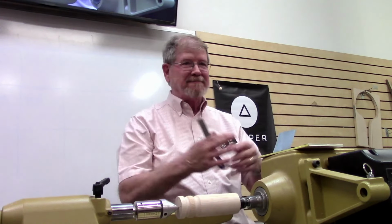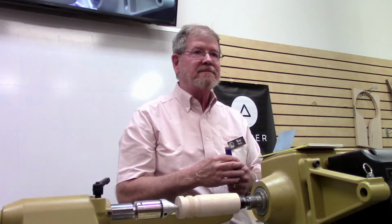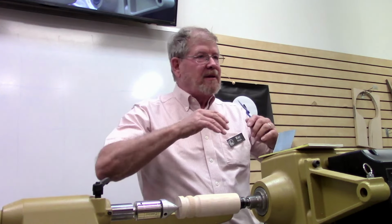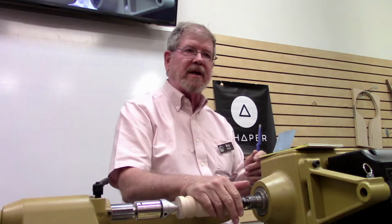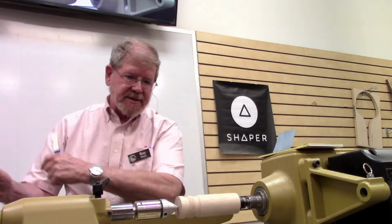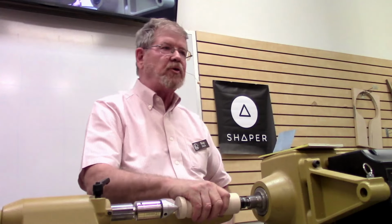I guess I'm done. Any questions? So it's one of those things that looks easy, but if you pull too fast and crosshatch it, all you do is put a piece of wood on your lathe, and if you mess it up, take your roughing gouge and go across, sand it quickly with 150 and try it again. And with that one piece of wood, you can master the tool.